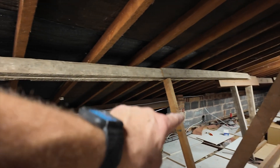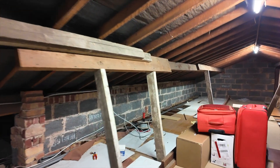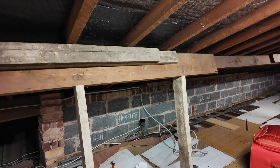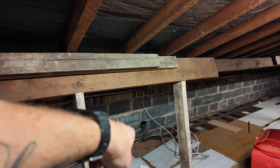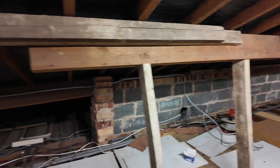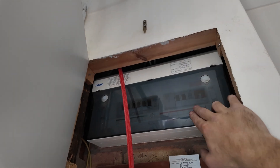Lou has clipped all the way round, tracked across the top, and measured all the way down to go down with the cable. You can see that hole down there — that's where the consumer unit is, literally straight underneath. He's cut the cable where he needs to, and now I'm going to go outside and get the route sorted for the armored outside.